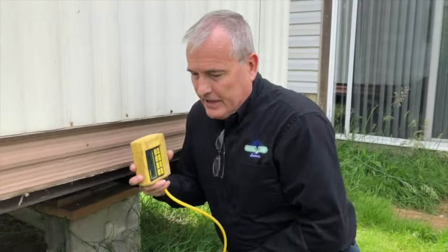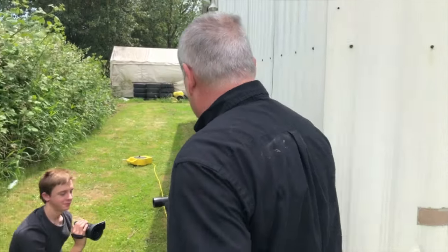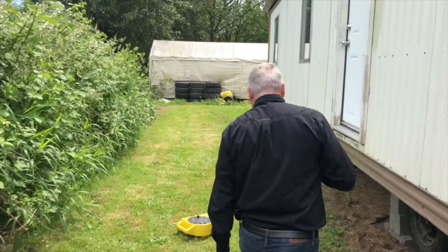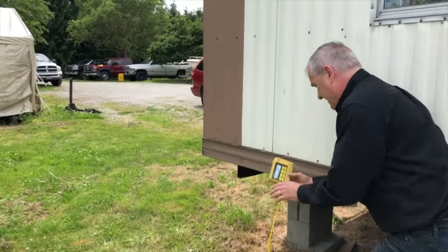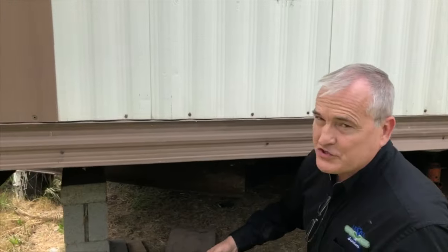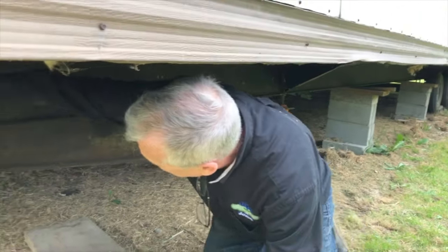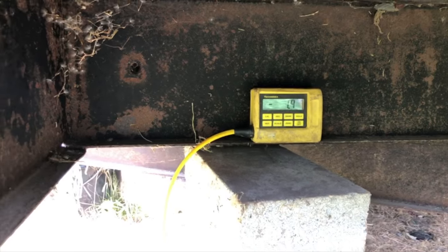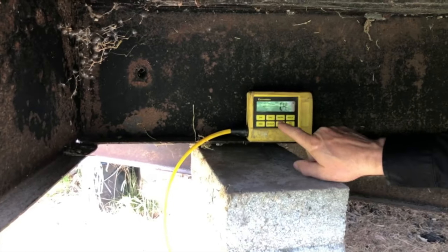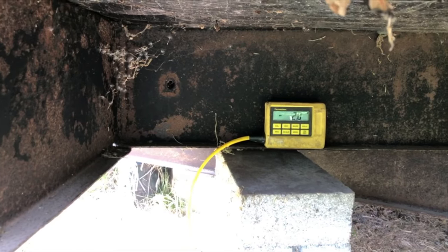For illustration purposes we're gonna go way over here to the other side of the house and show you what's going on. We almost never get the luxury of being able to walk around the house like this. So now we'll look at this far corner here and we see that it's negative 1.9 inches — almost two inches lower at this spot than where we started.